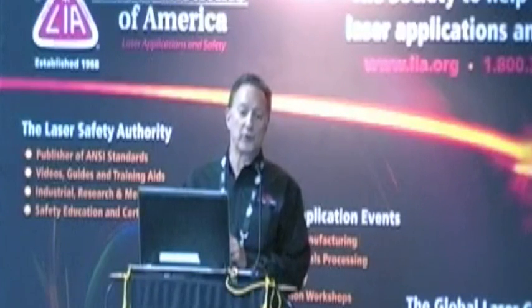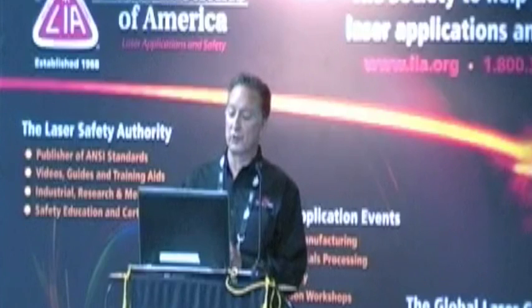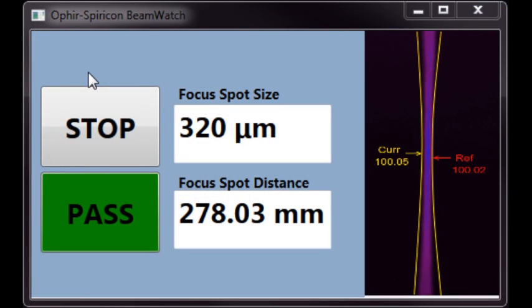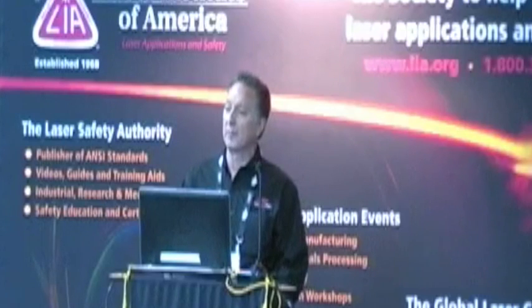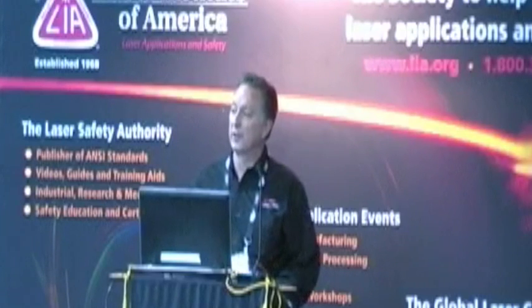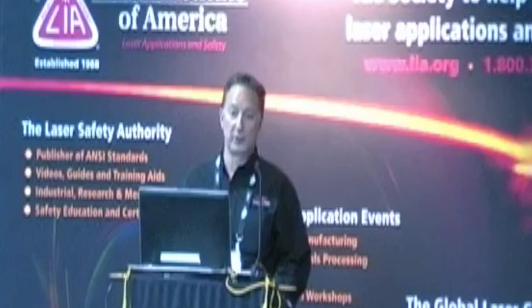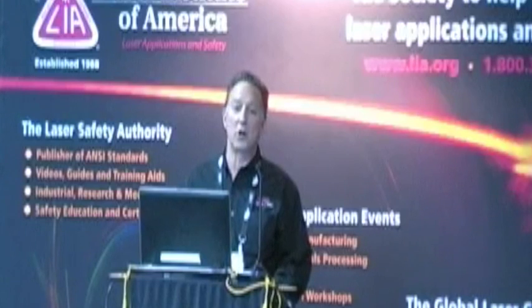Here you see a technician's screen showing the measurement of the beam spot and the location of the beam waist itself. Beam Watch comes with two user interfaces: the technician screen for advanced diagnostics when a problem occurs, and the operator screen which monitors those two critical parameters — spot size and actual location — while in use. It also monitors user-inputted pass/fail locations, so the device can be completely automated and will only notify you should those measurements fall outside the critical design parameters.